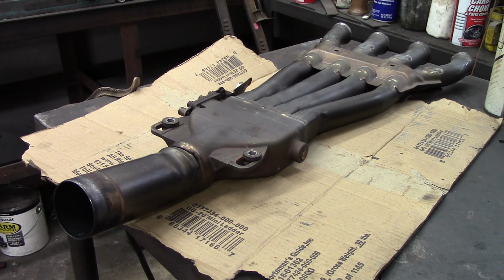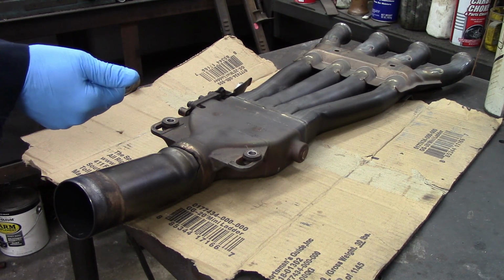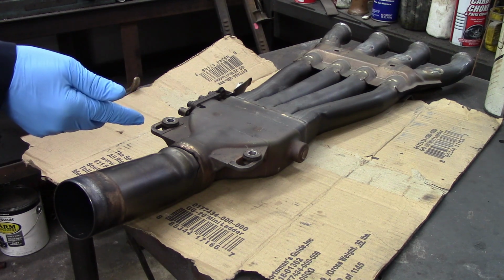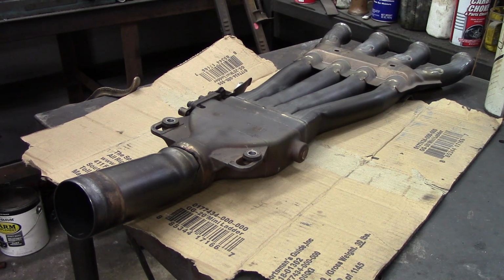it seems as though the biggest thing with titanium is cleanliness. It's very touchy when it comes to contamination. According to stuff I've read, just the oils from your fingers, if you touch it without a glove on where you're going to weld, and you don't clean it with acetone before you weld on it, the contamination will embed in the titanium and you won't be able to get it out. So cleanliness is the big thing.